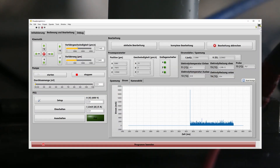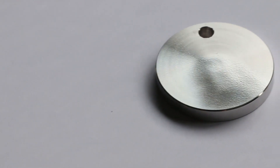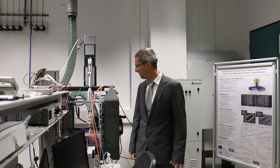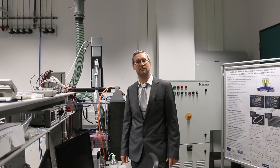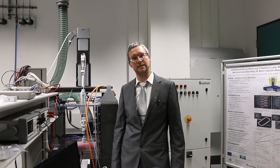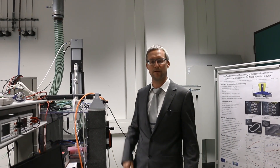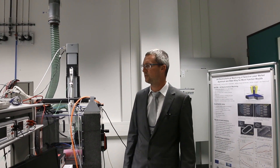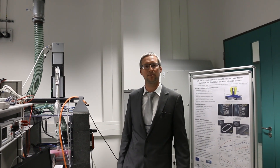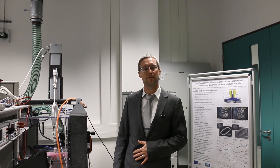The start of the process is characterized by a high current peak of up to 22 amperes. We have a glow in the center of the ablation area. We are working on further developments of this technology for reliable initiation of the process and to get the process continuously working. That's it for the laboratory of the jet-based electrochemical machining technologies. Now let me introduce you to the laboratory for immersion-based technologies, which is guided by Mr. Petzold.